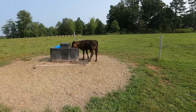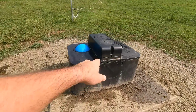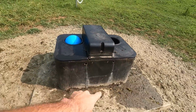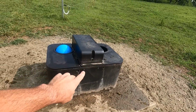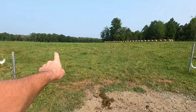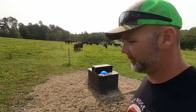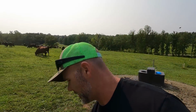Now, this little guy's thirsty. This is called a Mirafount 3390 waterer. There is a water trough right here. It's a frost-free or freeze-proof water system. There's a heat tube that goes down in the ground, concrete pad around here, and then there's plumbing for this. And plumbing comes up, goes to that one, and goes to the next waterer and the next waterer. There are 7 Mirafount water fountains on this side of the farm. On the other side, we have tire water tanks, which work great also.